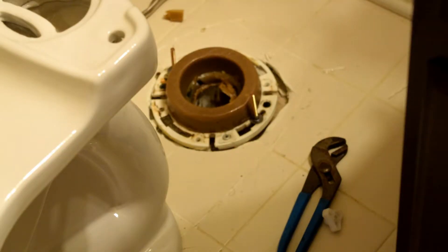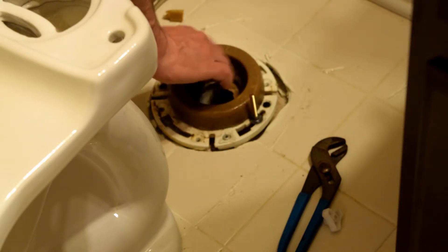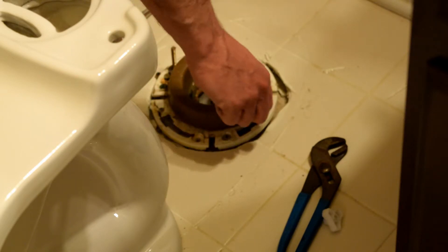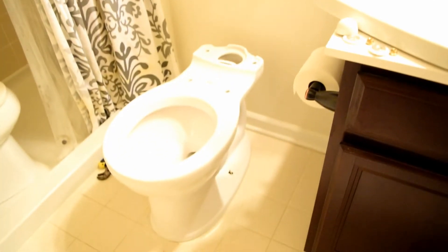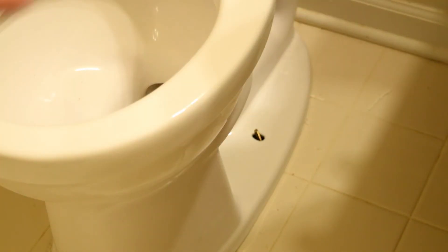I decided it was a good idea to put the new wax ring on. It was as simple as just taking the wax ring and dropping it on here — you should smush it down a little, but let the toilet do that. I made sure my bolts were on either side of the toilet bowl. When installing, line up the bolts so you can easily mount your hardware back on, and that also makes sure that the hole at the bottom of the toilet is matched up with the hole in the ground, which is really important so water doesn't leak.